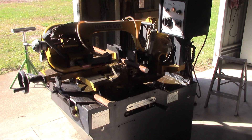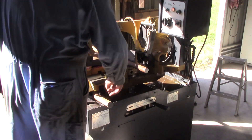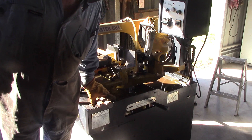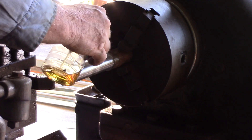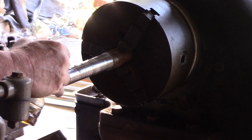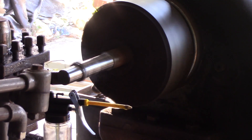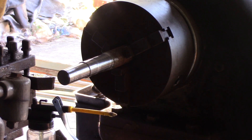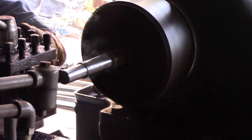I'm cutting off the two stub axles now — a bit of an overkill at 300 millimetres each, that's 12 inches for the people across the Pacific. I've got to take them over to the lathe and turn them down to the size of the wheel bearings. Running them down on the lathe now, already taken a couple of runs, taking a fiftieth of an inch at a time off. I've got about three more runs to go, though the tool might be getting a bit blunt — I think I need to replace it.